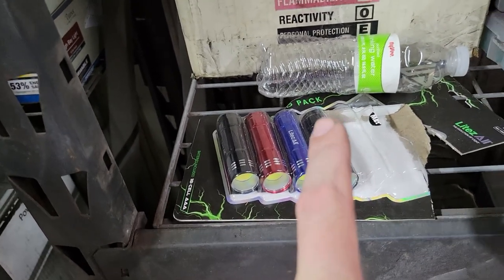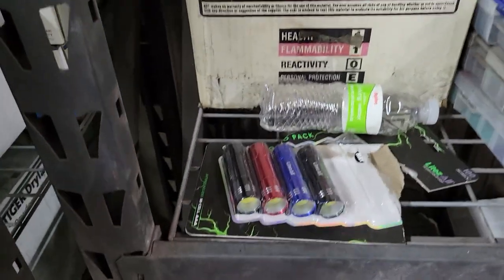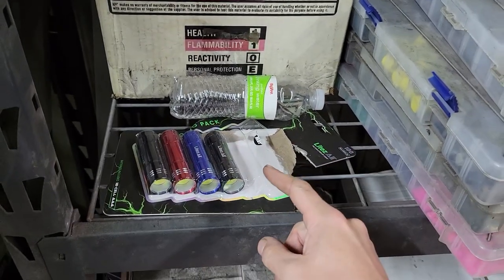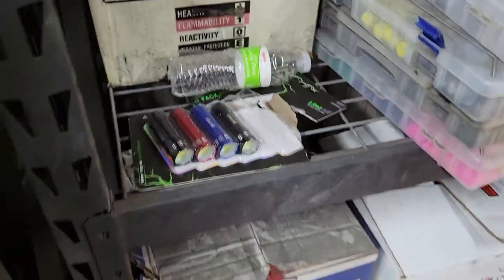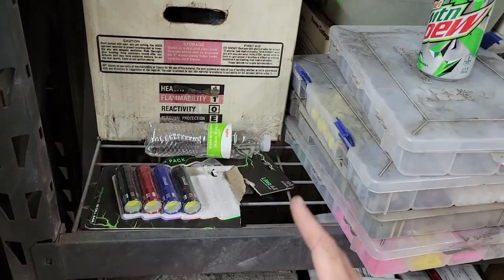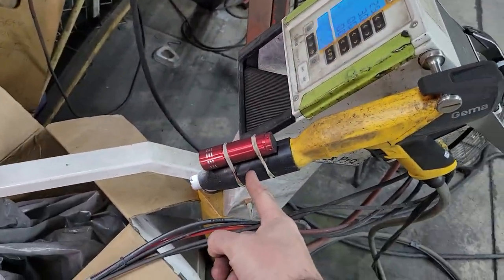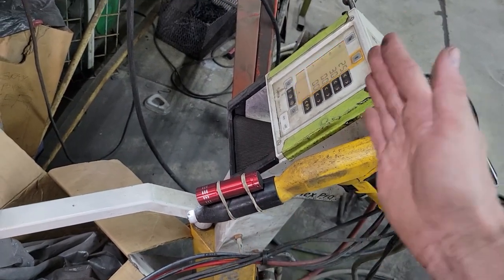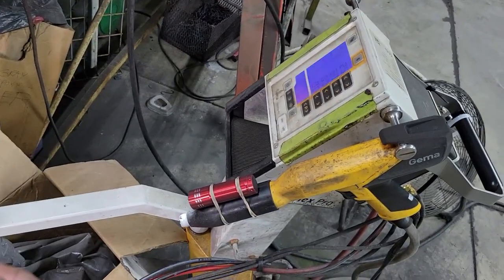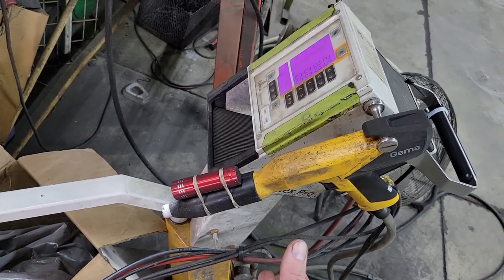Right there folks — a flashlight. That's it. For less than ten bucks — I think it was $9.99 for a six-pack of flashlights from Menards. If you're not in the Midwest, probably Home Depot, Lowe's, that type of place. We've used flashlights in the past to check for light spots, not a big deal. But what all you other coaters have already figured out — attaching it to your gun — is a game changer. Not only has it helped me slow down and coat parts more efficiently and effectively, it's basically erased most of our redos completely.